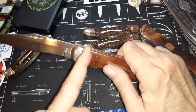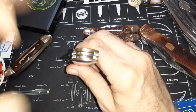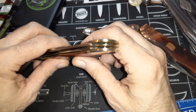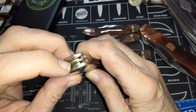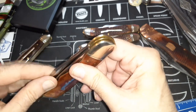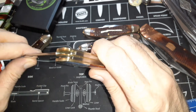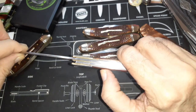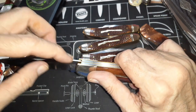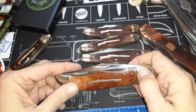If this is cut 90 degrees and perfectly straight, everything's fine. But if you start getting wonky... the center face right here is your lock, so that's usually easy for them if they just cut the metal straight. It should be the same way on the tang. Sometimes they get crazy when cutting the area for the pivot, and if it doesn't line up — I've had them where on that Marbles lock back you can pull up and feel it rocking even though it's locked. This one's not like that.